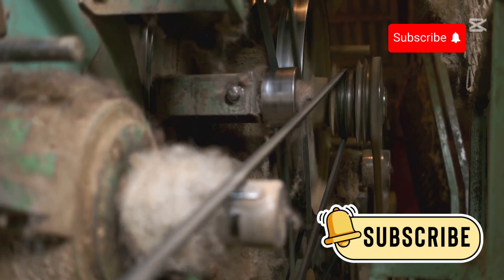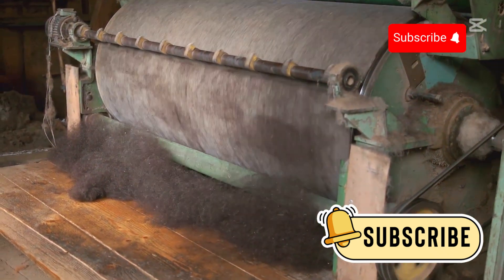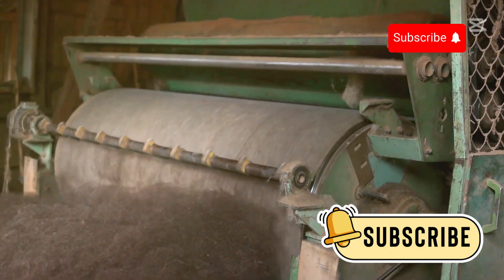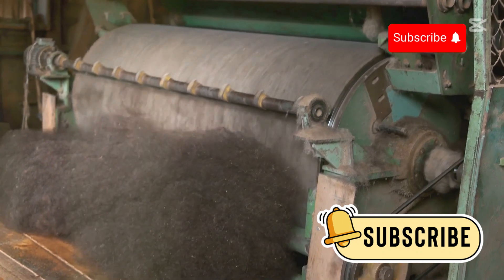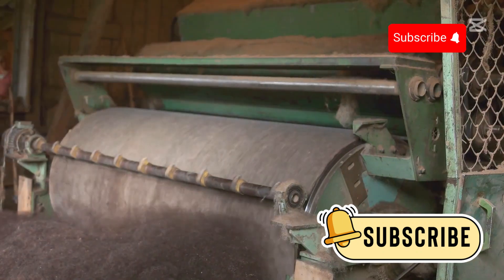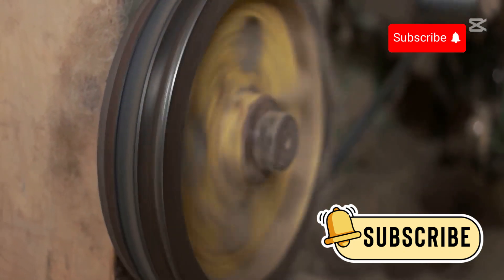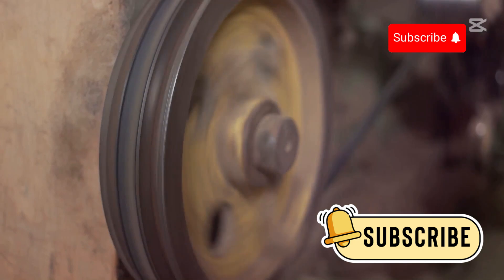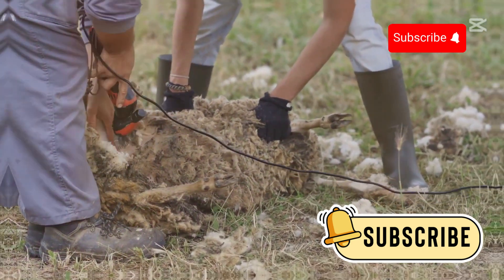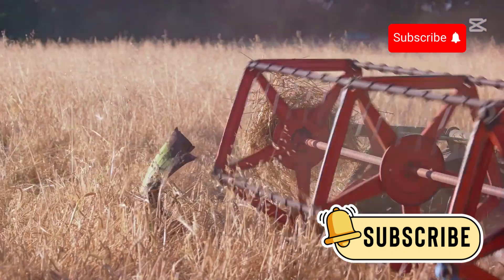Farmers can use sheep wool balers to store wool more neatly. First, the farm will put the sheep wool into a storage chamber that is in line with the sack. Next, the machine's compression system is activated to press the sheep wool down into bales. The farmer then adds more sheep wool into the empty space. When the desired compression is reached, the machine automatically maintains pressure for around 10 seconds for the sheep wool to form a bale, then ties and releases the bale from the machine to prepare it for sale.